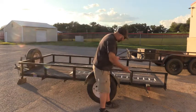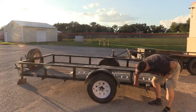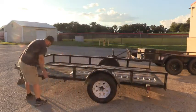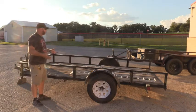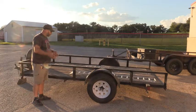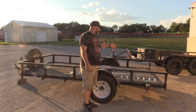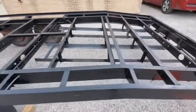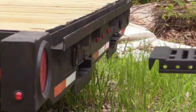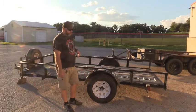Towards the back of the trailer is an option. We've got our rail here on each side — one option is to slide them under from this direction, or from the other way. We're showing the driver's side but for safety reasons we're going to do this off the passenger side. That way, if you have to park on a curb or on the street, you're not unloading your ramps into traffic. My ideal positioning is off the back, but that would make the carriage hang low. You can see we did that on the back of a fifth wheel car trailer we built, but you just don't have the clearance. If you catch a driveway or something, you're probably going to lose the ramps and the carriage.